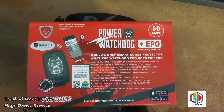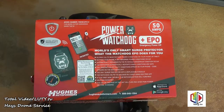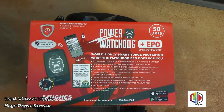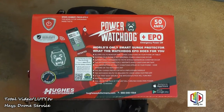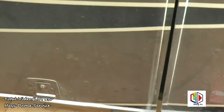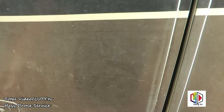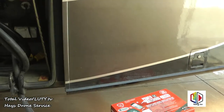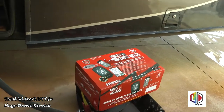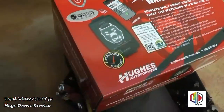It's a hardwired model — you can get one that plugs into the outlet at a power pole in a campground if you want to do it that way. I'm doing the hardwired model because I want protection on the generator also. I've had a Progressive Industries surge protector for several years and it's fine. The Hughes Autoformers unit has an app so you can monitor power usage, and I want that — I guess I'm probably a little too nerdy.